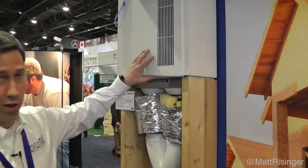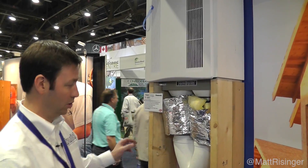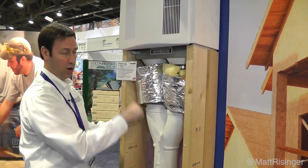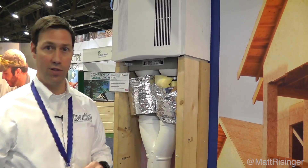We want to build the tightest house we can, do a blower door test, and make sure we build it tightly. Then with an ERV like this — which is a balanced system — it has two pipes: one bringing in fresh air and one exhausting stale air. Even a super tight house will have fresh air. This one has two settings: a low setting for smaller houses and a higher setting for bigger houses, which you can also change seasonally. It's a really good product at an amazing price point. Thanks for joining everybody, we'll see you next time.